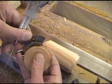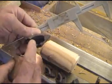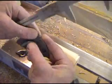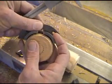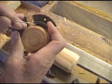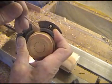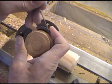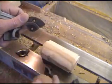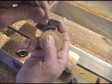We hear a lot about tenon size and fitting the jaws. Alright, what we're looking at on the standard jaws, like the Barracuda, that are just rounded on the inside. Okay, when the four jaws go together, we end up with this round. Okay, when we get a larger tenon like this, those jaws are going to be open, and what they look at is that it's only going to hit here and here, and the center is going to be open. So they're saying that we've got four jaws, so we only have 8 contact points that are going to hold that. If we get down to a smaller tenon that's more the size of the closed jaws, we can decrease this gap in here.